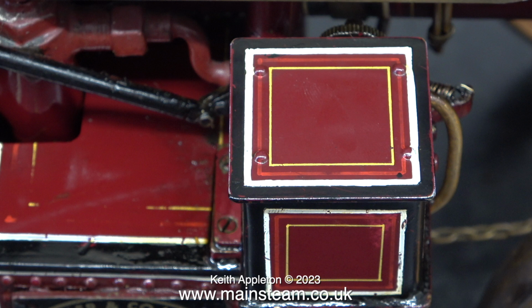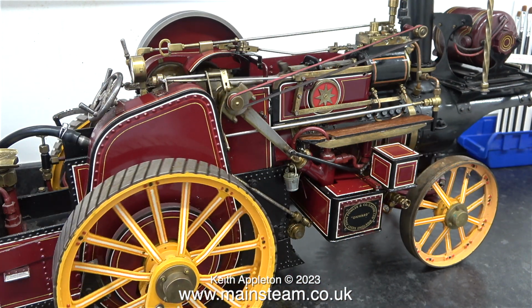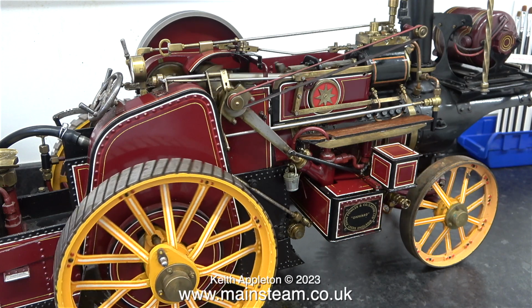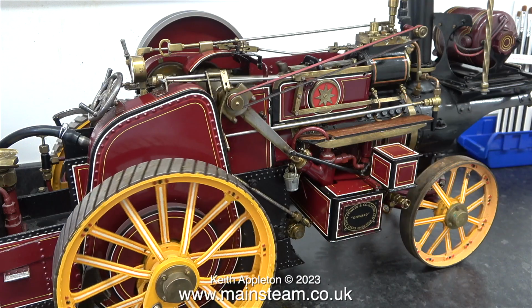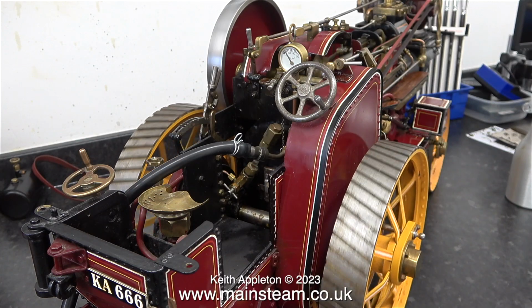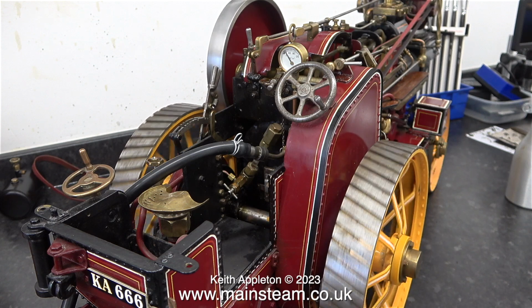Nothing more to say about that, but I think I'll feature this in a video, showing the components in more detail. In this clip I'm doing something wrong. There is no synchromesh available on a traction engine. You must always stop the engine before changing gear, and make sure the gears are in mesh before you open the regulator. That's it for this one.